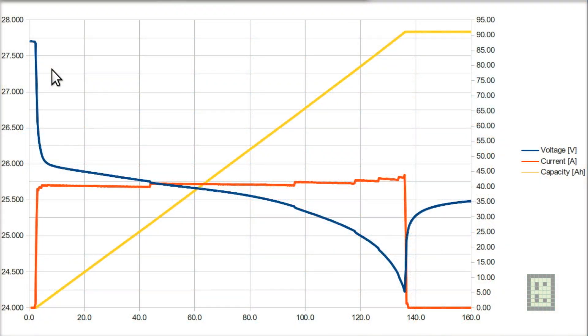This is the first graph for the GBS battery. As you can see, the blue line is the discharge voltage of the GBS battery and it took just over two hours since this was about 0.45C. I wanted to get to 0.5C to be as close as possible with the discharge curve of the A123 system, but the inverter was more efficient than I expected, so it was only 0.45C discharge rate.